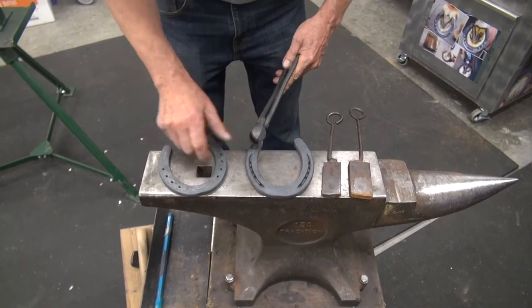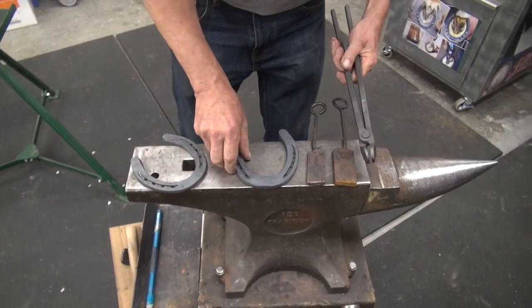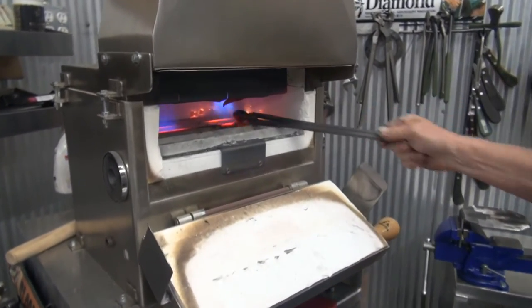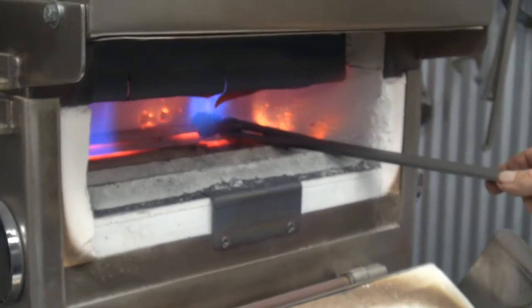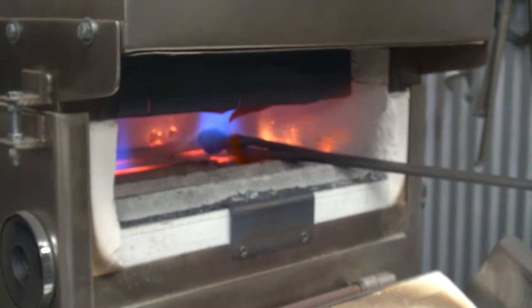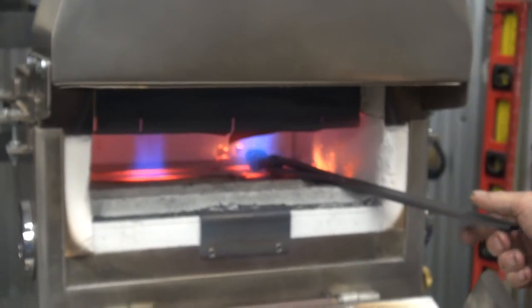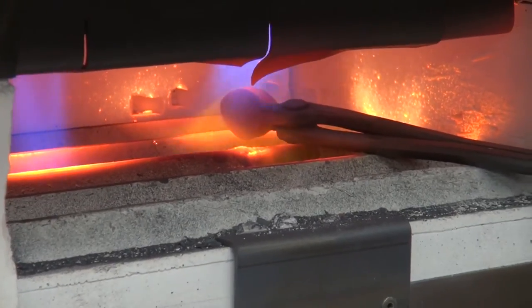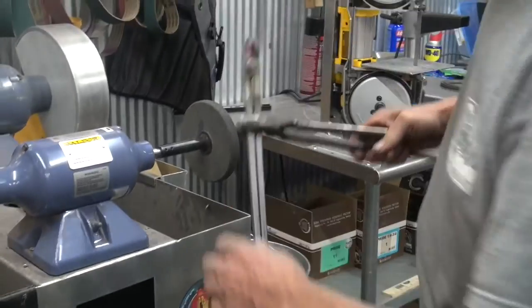Let's go ahead and set it for the 5/16ths. We'll set the jaws, and then we'll work on the back. So the first thing we want to do is to adjust the jaw, so we're going to put that in the fire. We're going to try to get a nice uniform heat on both jaws. Let that warm up. At any time in here, if you feel the tongs are getting warm, there's no reason you can't travel over it and quench them off. Not enough heat down here to bother anything.